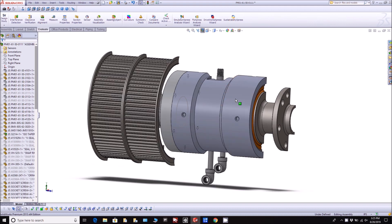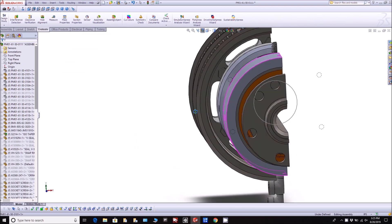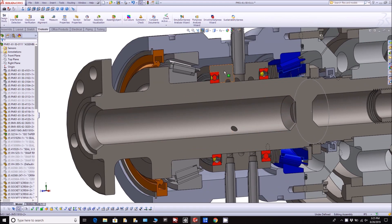We're going to run full oil through this thing so there'll be no grease in the bearings anymore. The drains coming out the bottom will be basically blocked up, and any oil coming out of that oil collar will just go into the housing itself and fill up to that drain level, at which point it will drain back into the sump. Spinning this around and looking inside, you can see the configuration — this is the old configuration in CAD since we haven't changed it yet. Those two drain tubes at the bottom are going to disappear, but the holes coming out of the collar will still be there, allowing oil to drain out while still going through those two side bearings.